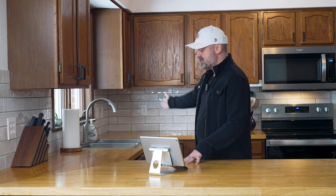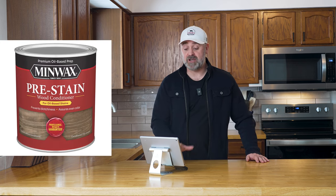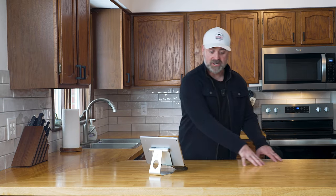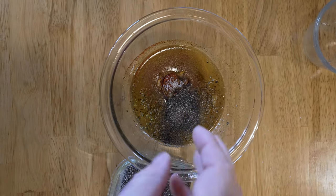Once installed, we cut out the sink and then I gave it a really nice sanding. When you get these slabs in, they have very sharp, pointed edges, so I took my palm sander and went right along the edge in a smooth motion to round it out. You can get fancy with it if you want — I kept it simple and just gave it a little rounded angle. Once sanded and vacuumed up, I added a coat of wood conditioner. That was the most exciting moment — all the grain and natural beauty in the wood really started to reveal itself, and we knew we had made the right decision.